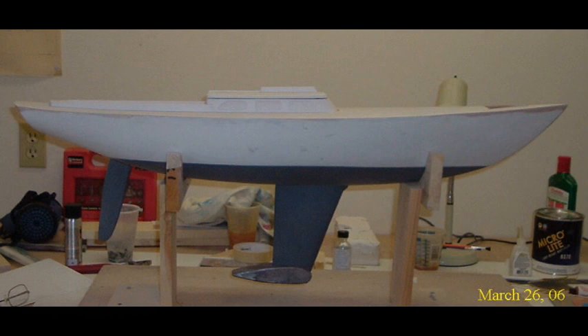That means to get the same effect you need to increase the size of the keel foil area, and you also have to make the keel deeper so that the ballast effect of the lead ballast on the keel is greater and will keep the boat more upright.